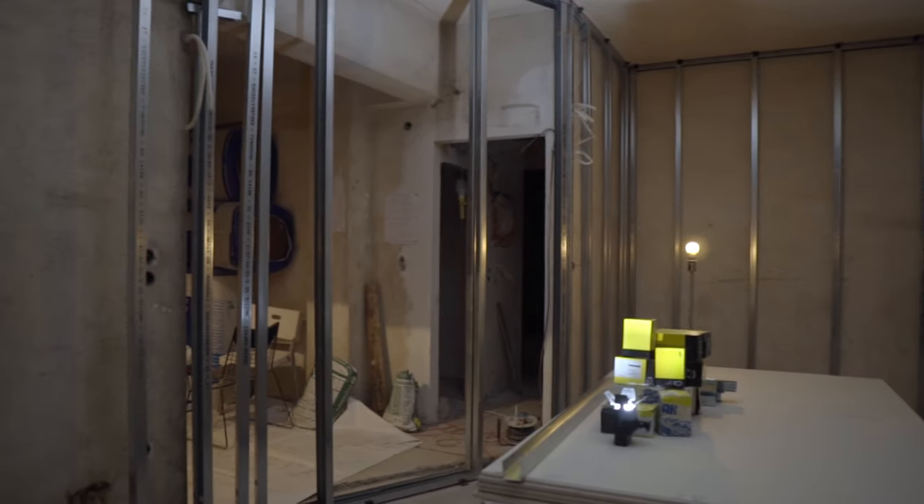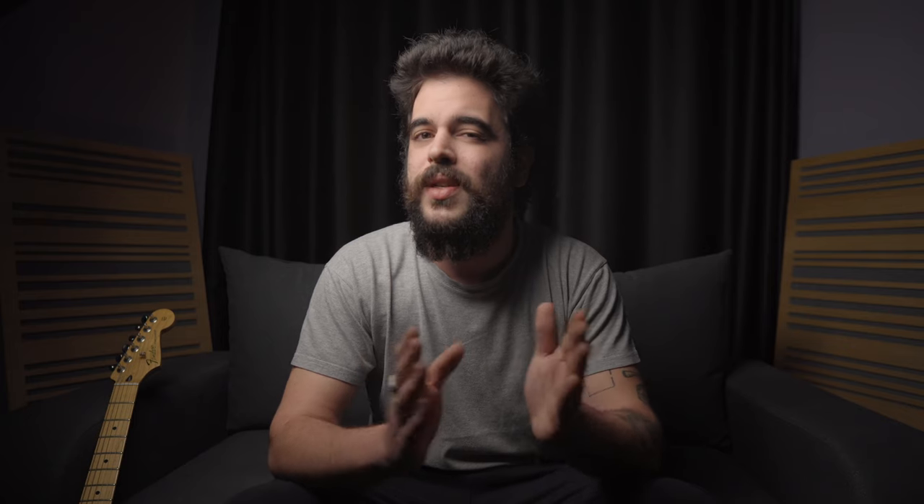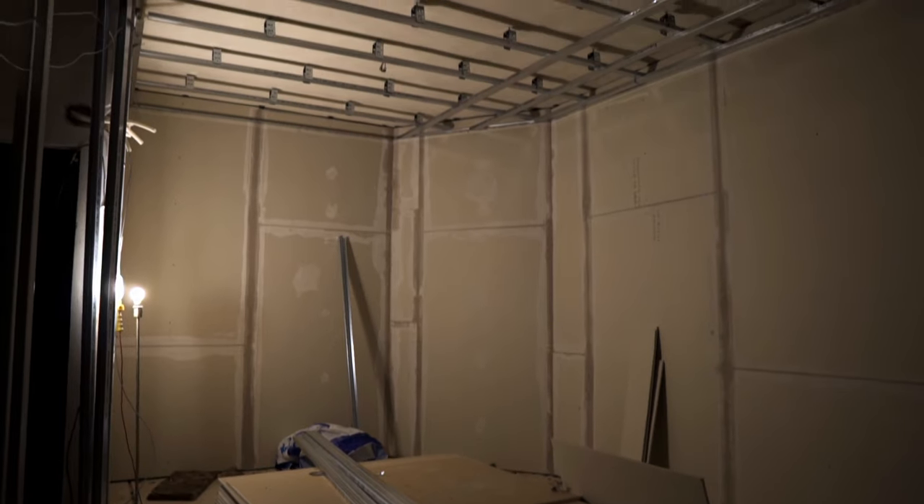After leaving a very small space of about one or two centimeters from the existing wall, there was a layer of insulation about five centimeters thick, and after that a double layer of drywall with mass loaded vinyl between it. The ceiling, which was connected with the walls, was also a double layer of drywall with mass loaded vinyl between it and a layer of insulation above it.